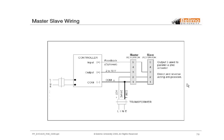On dual applications, for those familiar with Belimo, on any dual application mount on either a damper or a globe valve, what you want to do is set up a master-slave. You don't want to parallel all the wires together. You want to take the three-signal into a master, and take the feedback of that master and put it into the three-wire of the slave. This way, the slave actuator will know it's driving off a master, which eliminates some battling torque between the two motors on a common shaft and it'll run consistent.